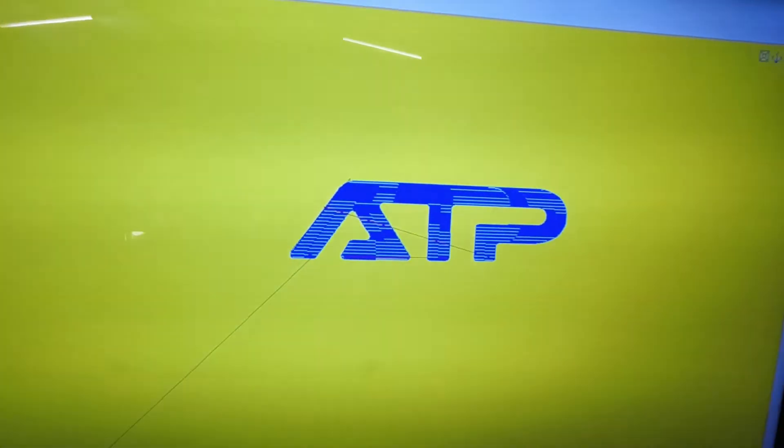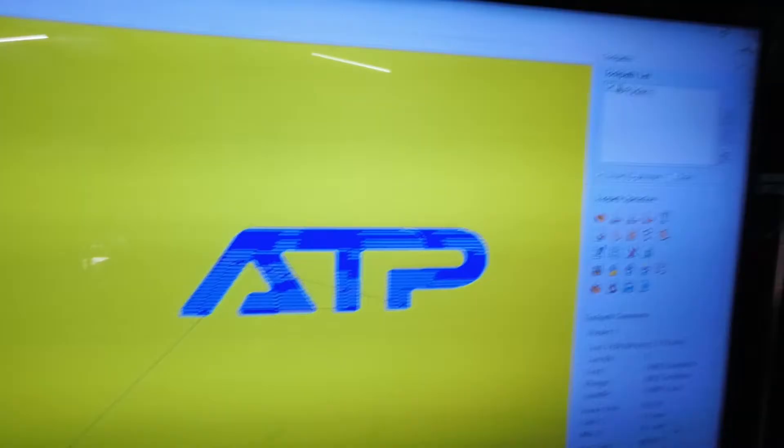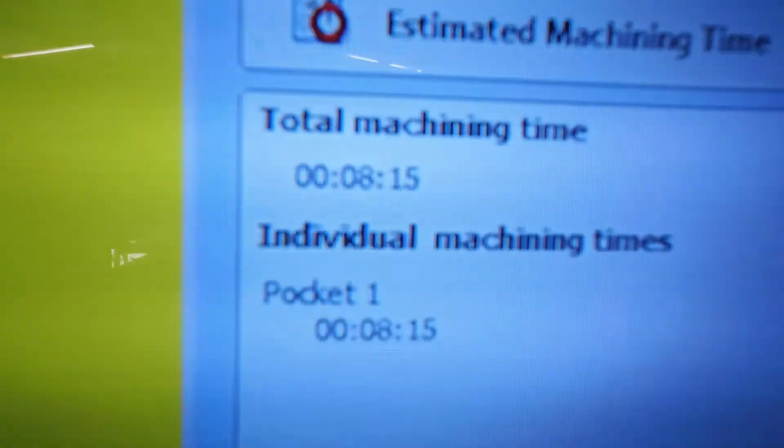Just for curiosity's sake I want to see how long that would have taken on the CNC. In V-Carve I've done a quick mock-up using a 60 degree V-bit, the same way that I would normally engrave. That would have taken 8 minutes, and I know from experience that would have taken 2 passes — so effectively 16 minutes. So 44 seconds with no clamping, no physical material loss. If I mess up I can simply strip the part and have it repowder coated — I haven't scrapped the actual material itself. Whereas on the CNC router I'd have to remove physical material, and if a mistake was made the part is scrapped and I'd have to wear the cost of all of that. 16 minutes to 44 seconds is bloody worth it, and no clamping is just a freaking amazing situation.